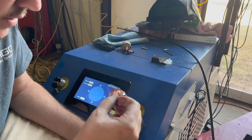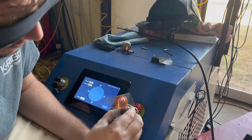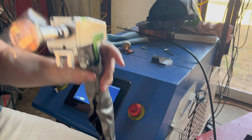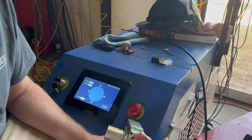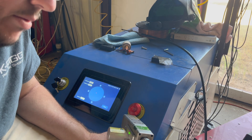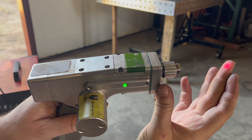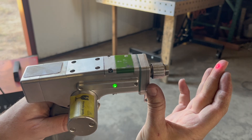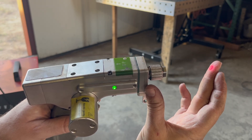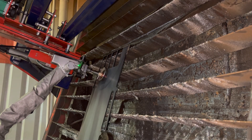Center the beam, then go in and out to try to find the smallest dot. It's really hard. For cutting material, we want that center point to be in the material - almost in the middle. Another way to see it: I put the wobble on and you can see on my finger it gets to a point where it gets crisp, and then goes blurry again. That is your focal point.